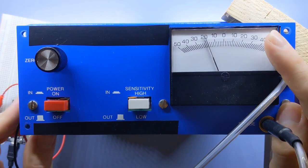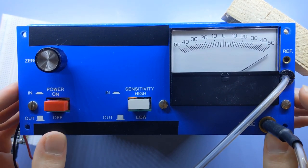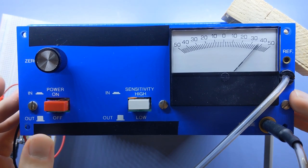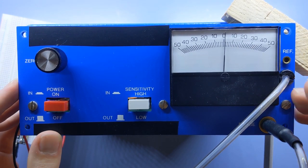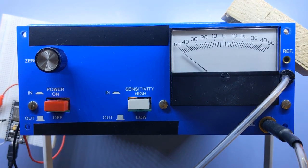Since this is a bidirectional gauge, the polarity of the inputs must be switched to utilize both sides. A pulse width modulated signal on the right-hand pin controls the right side of the gauge, and vice versa. Let's add the GPS.